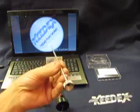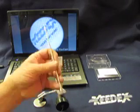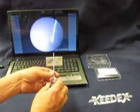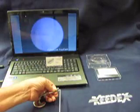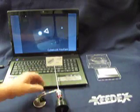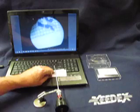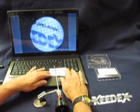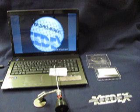My Hawkeye scope came with a 90-degree mirror tube. These are really great for looking around corners and they work very easily — you simply slide it over the bore scope and now you're looking around corners. The only problem is when you're trying to read a number or orient your scope, up is down, down is up, left is right, and once you finally get it oriented it's very difficult to read. For example, trying to get a serial number or a model number off of a safe lock can be a little frustrating.